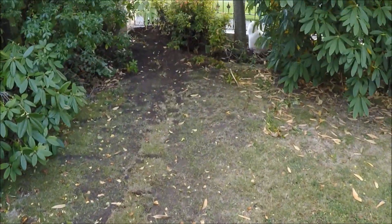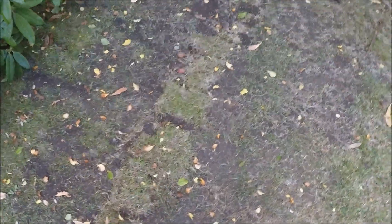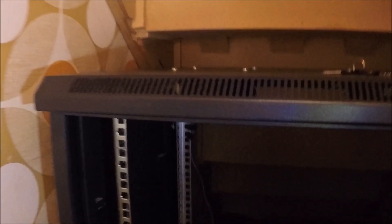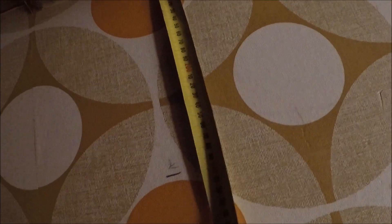I've filled the top of this trench in — not the nicest outcome but she'll grow back. Moving the cabinet out of the cupboard now. I'll cut a hole in the wall, marked and measured 300 high. Making sure there's not a stud here. I'm going to cut a hole in the wall and then drill up from under the house, and put a bit of conduit in the wall here — that'll be the draw wire for the fibre.